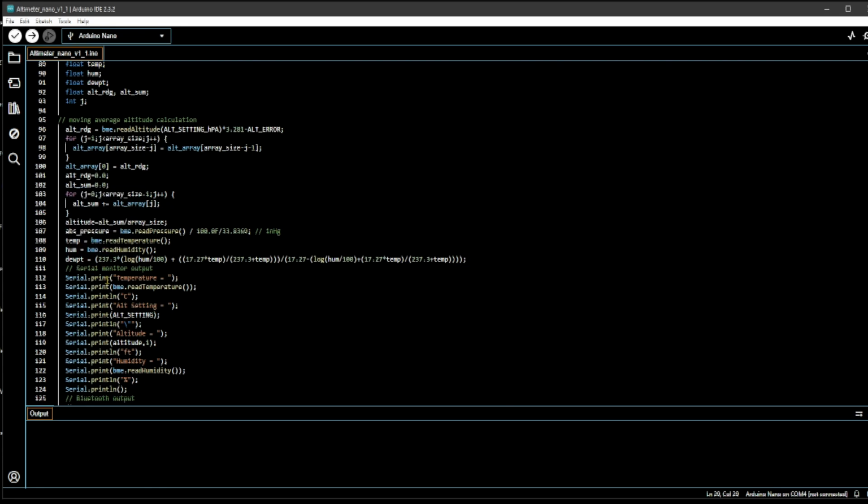By the way, the BME280 has internal formulas to do the conversion from pressure reading to the altitude. That is again a fairly empirical type formula which you can read on the internet. I won't get into that, but I've tried that as well, and it should work if you actually want to use the calculation using the pressure reading itself, which is over here. But it's tricky. You might make some mistakes. So it's better to use the built-in function here.